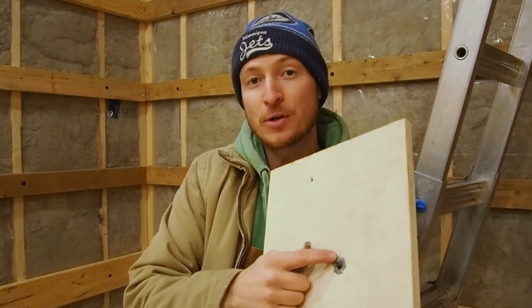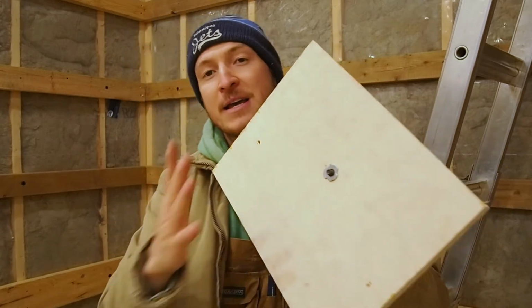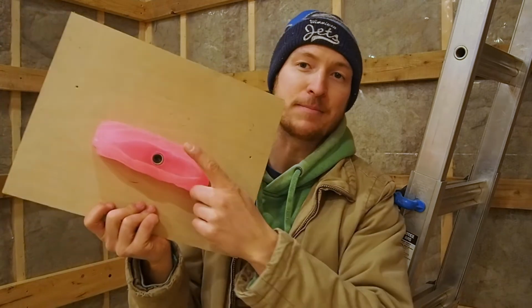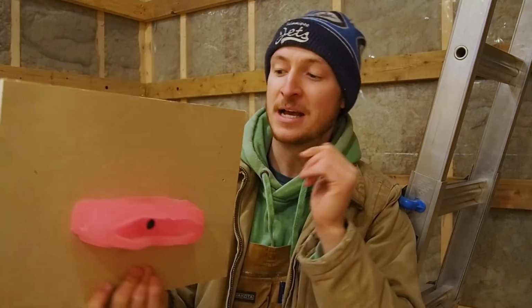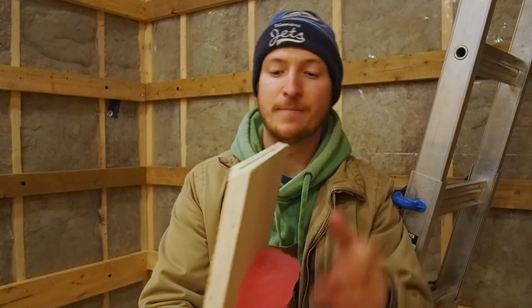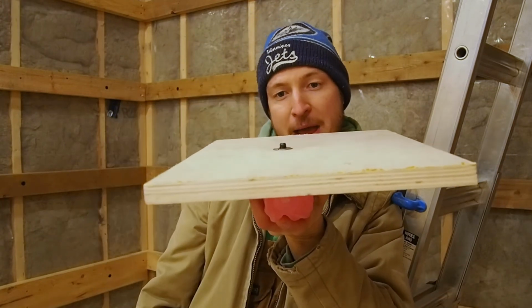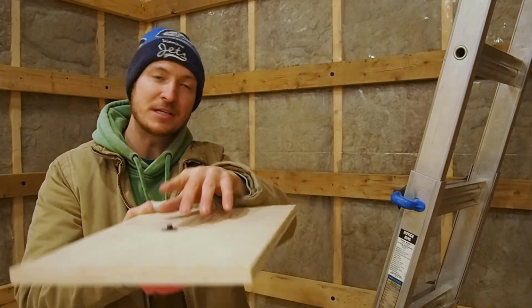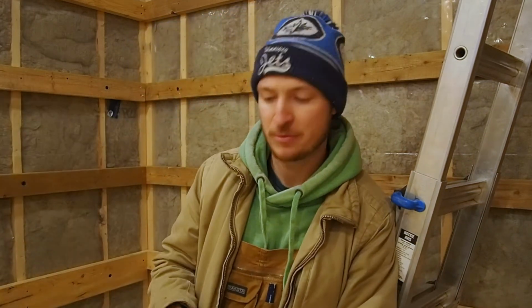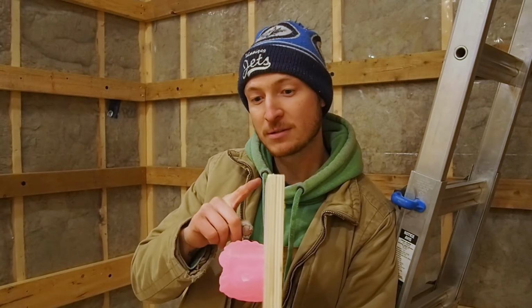In each one of those holes, we're going to hammer in a T-nut. That's that little fancy silver guy you see in the back. That T-nut is sitting there to accept these cap bolts. So the cap bolts go through the climbing hold, attaching the hold to the wall. Now you see how that bolt, sorry, protrudes from the back. That was one of the reasons why we created this extra space. I didn't want these bolts poking through my vapor barrier because, well, it renders my vapor barrier rather pointless. So that is how we're going to hold holds to the climbing wall.